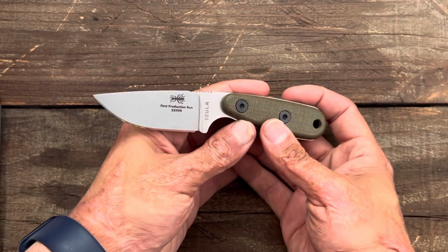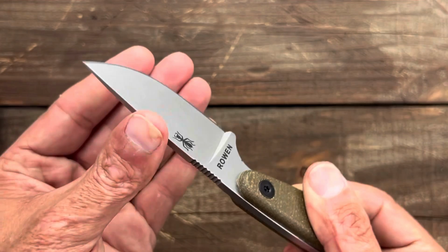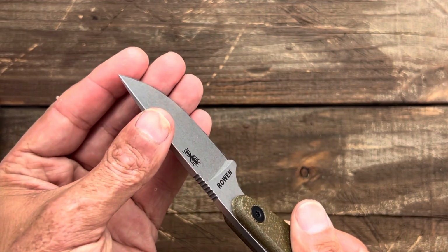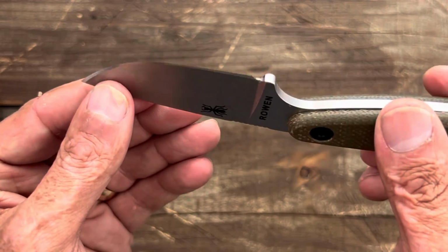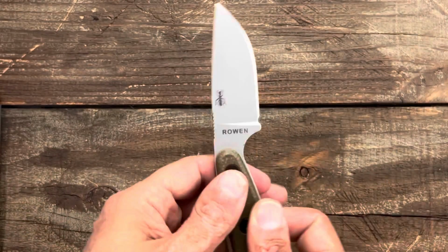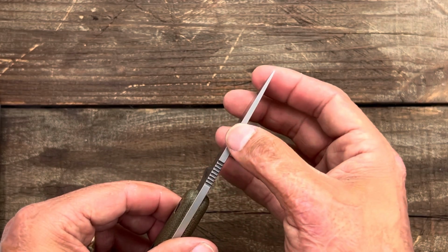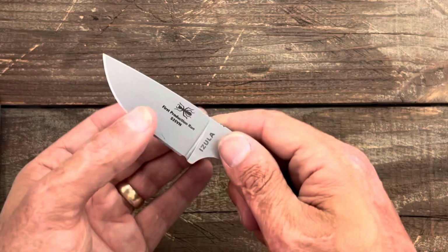It was very nice to sharpen this knife. It deburred very, very easily. And when I say this took one of the most sticky edges, I took it to 800 grit and then stropped it on 1 micron, and it's absolutely ridiculous. And I've already used this thing a few times after the testing, and it's still biting into my fingers pretty darn bad.